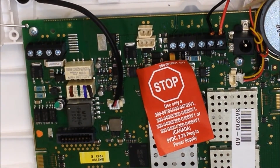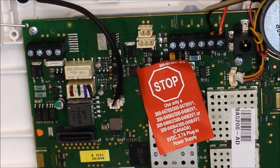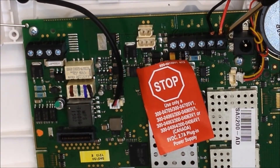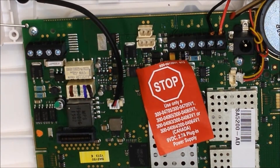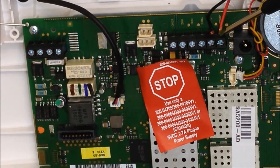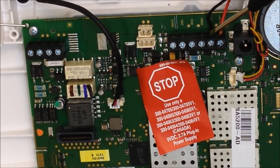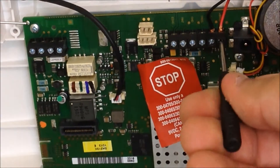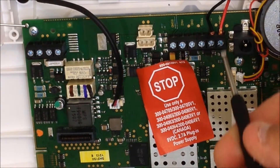Take the wire and strip it back a little bit, exposing the two wires inside. In our case we've got a red wire and a black wire. The first two terminals are the ones we're connecting to — the first one is your red wire, which is your positive wire. It'll say 9V DC on the actual green terminal, and that's for power. The second one says GND for ground — that's where your black wire goes. Simply unscrew the terminals all the way open, slide your wire inside the top of the terminal, and once it's in nice and tight, screw it back down.